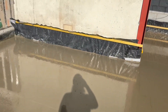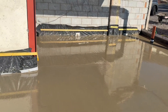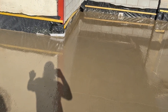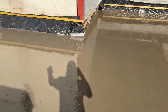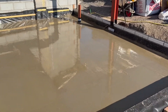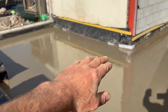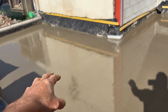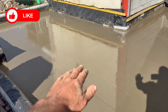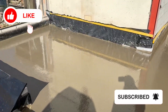It was a success - no dramas. That's the finished product. Apologies for the terrible quality of the time-lapses. I've told the customer to sheet it over this afternoon to protect it from drying out too quickly as it's getting quite hot with the sun. It's bang on with the laser all the way round. I'd mention as well that even though this isn't the finished floor, you should spend time getting this as level as possible with your laser and as flat as possible with your darby bar, because your insulation is going to sit on top and you don't want any undulations causing deflection from the floor. The flatter the better.